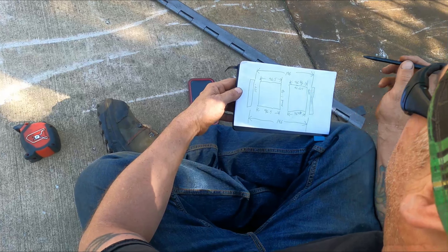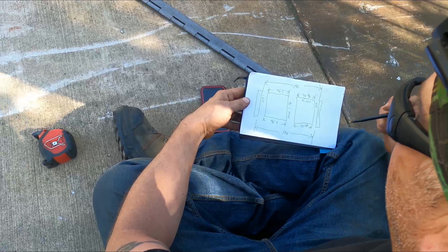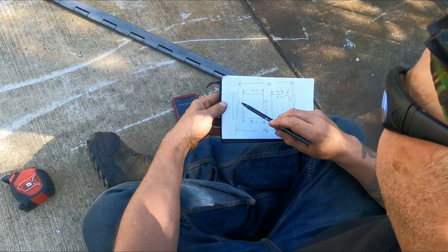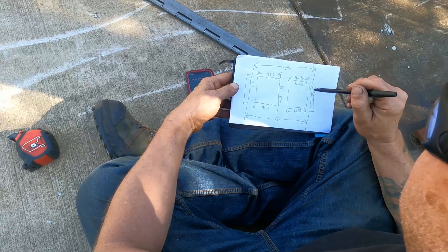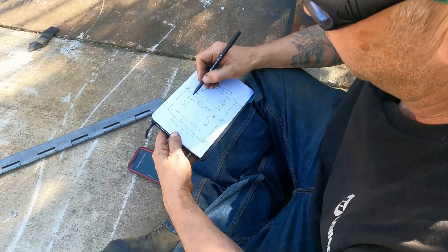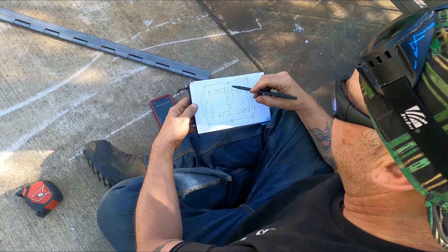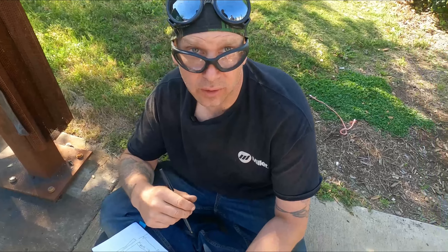These are our upright posts here and here, so I wanted to make sure we had the same distance at the top where the hinges are as well as at the bottom — and that distance is 196 inches. The new hinges measure 5/8, so I have to put a 5/8 value on the right side of the gate and the left side of the gate. That's the space the hinge takes up. So if I take 196, take away 5/8, take away 96 and a half, take away 96 and 5/8, and take away another 5/8...